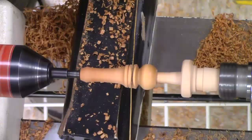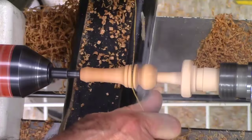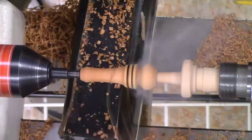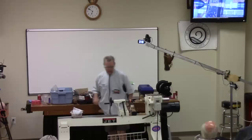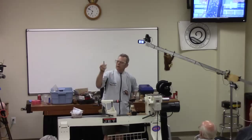And then instead of pressing down on it, this may be intuitively obvious to the casual observer, but it wasn't obvious to me. I was turning with Bob Alday, and he said, well, you need to drop your hand on the back so you get enough friction for it to burn fast. And it's like, duh. And, you know, there we're done. And you can make something similar.